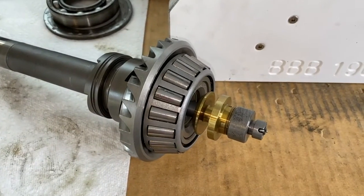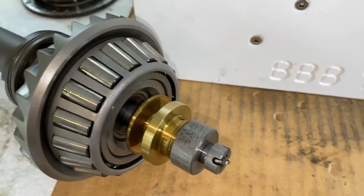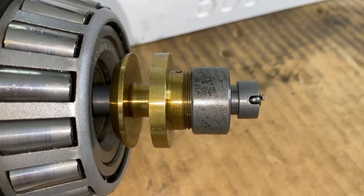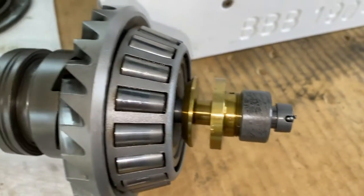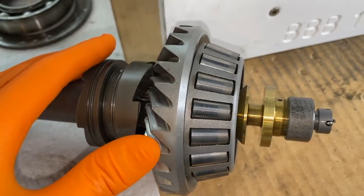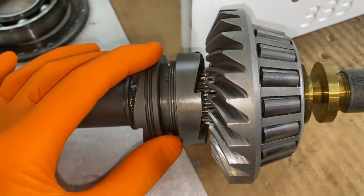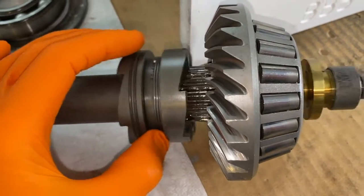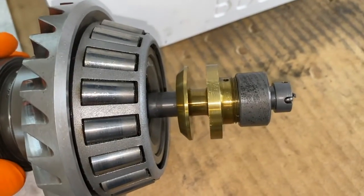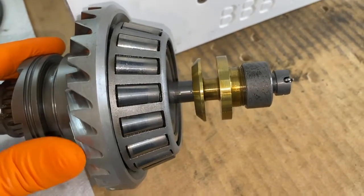I've now repositioned the entire propeller shaft. There is a closer view of the bearing and the rollers and that gold piece - that is the shift mechanism that your internal shift crank goes into. That is what moves the entire clutch dog as you shift from forward, neutral, and reverse. This is the forward gear and the shop was kind enough to lubricate the splines on the propeller shaft prior to installing the clutch dog. It moves very nicely. When put in forward gear, the shift shaft moves the lower shift crank and it pulls this forward and locks the clutch dog in and spins the forward gear.